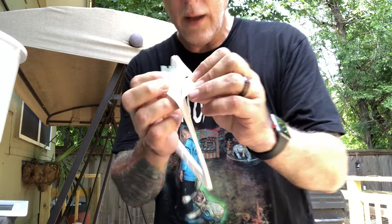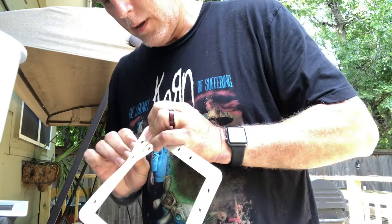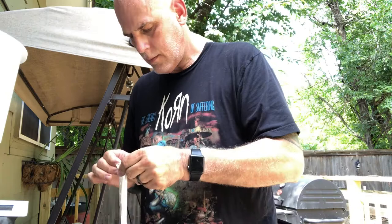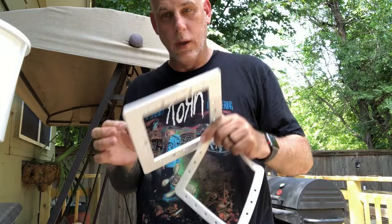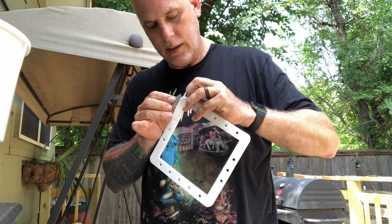If you're going to put this on with your pool full like I am — I'm not going to drain it — you want to take this rubber piece that has the two-ply and get a razor blade and cut it, because you're going to use one piece on one side and one on the other side. Make sure you don't cut your fingers or anything else — do a straight cut all the way down and around. What you really want is this gasket on both sides: one on the inside of the pool and one on the outside. The only way to do that with a pool full of water is to cut it like this.